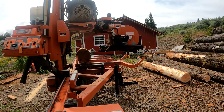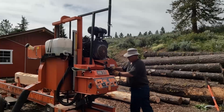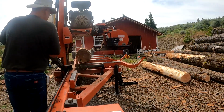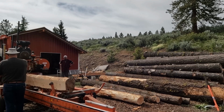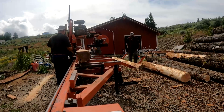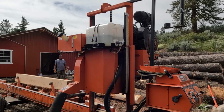into the side supports. And I'm telling you, this is the most productive way to mill lumber on one of these mills. Rolling at 90 degrees takes less time, and it gets you into a position to get that perfect 90-degree perpendicular face for your cant right off the bat. So we go ahead, we roll it again, drop the side supports out of the way,